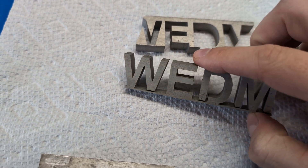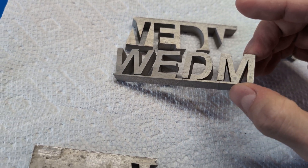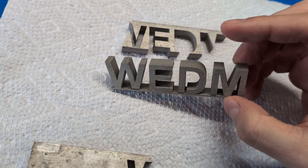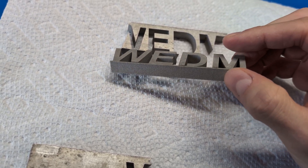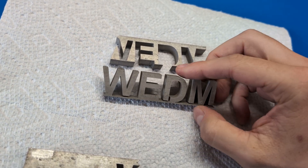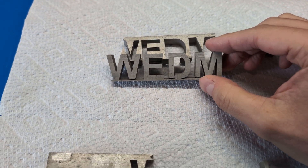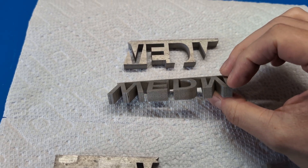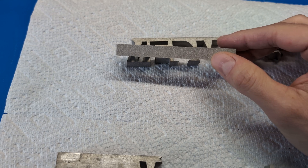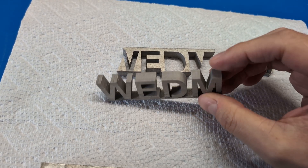On the V you can see a little non-consistency in the line — I think I had bumped the machine there. It's incredibly sensitive to bumps, mostly because being a desktop wire EDM machine it's not super rigid; it's not built out of cast iron, it's built out of extruded aluminum held together by 3D prints. So it does move around and is pretty flexible. But as long as you don't touch it, it's pretty good and you can get pretty good quality cuts. For most things it'll work just fine, and with a little bit of post-processing — maybe sanding — you could polish this up and make it absolutely beautiful.